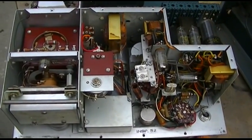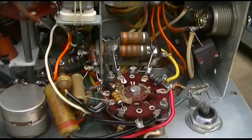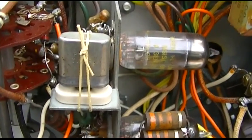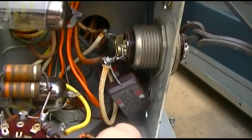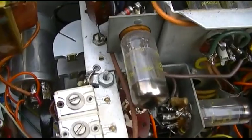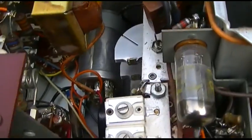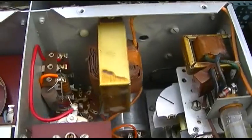Okay, so here's the inside. Nice crystal in a ceramic socket - that's kind of neat. A crappy mica domino cap there - I'm sure that's bad. Another domino cap here. Looks like it's got some paper capacitors in it too.